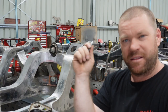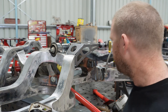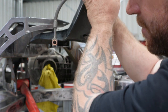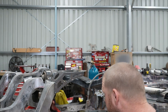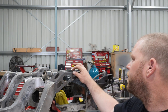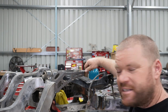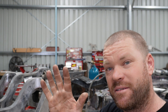With the power of editing, that is all tacked in. I've got the upper control arm in — going down is obviously not an issue, it's going away from it. But see up the back in here — it's just starting to touch there. It just starts to touch, and then it's going to be another 10mm to go up. So I'm going to take that arc a bit higher, and both of these two side pieces I'm actually going to bring up above this plate as well — maybe another 15mm — just to give it a bit of extra web around this side. I'll extend this one out another 10 and make a few adjustments on the computer.